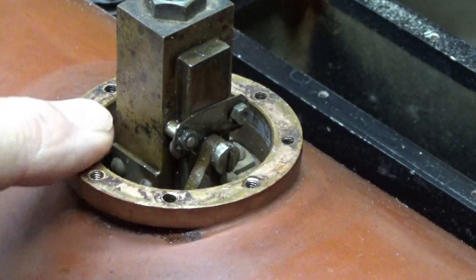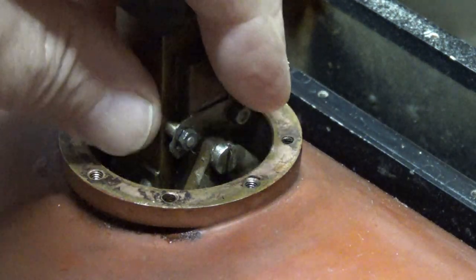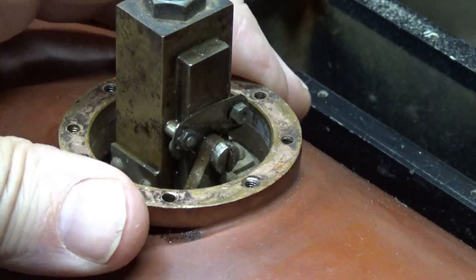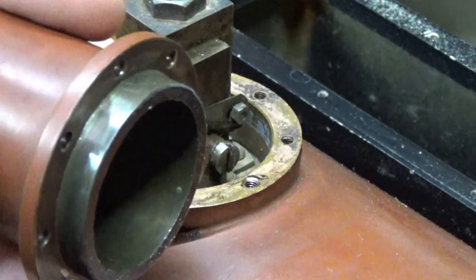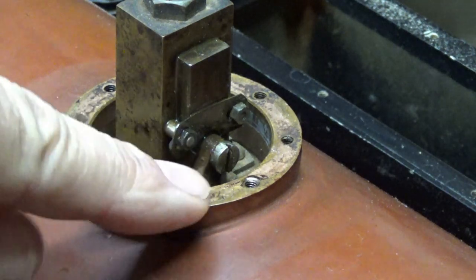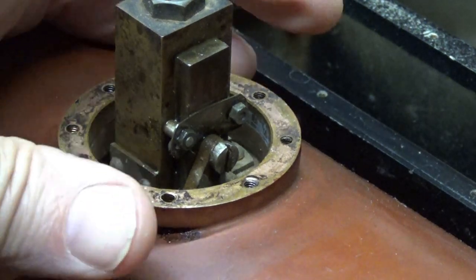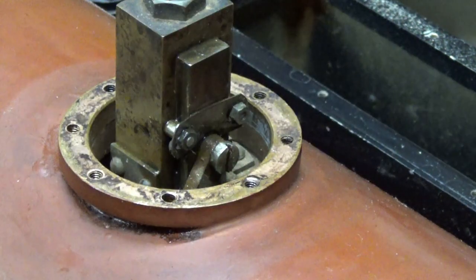As a side project, I put a little bit of steam oil lubrication on this so that I could move it easily, because normally it uses wet steam as a lubricant. It's a little stiff without any pressure. I put a little steam oil in on the advice of my friend Bob. Now, when I took it off, this surface was just about metal to metal. So I think what I'm going to do is create a gasket — it looks like there may have been remnants of one, but it was pretty much metal to metal, and that's not ideal. Let's cut a gasket so when we put this back together it'll be a proper seal. We'll do that over on the workbench in just a minute.